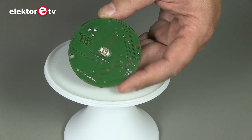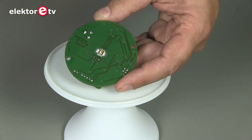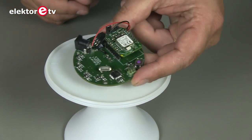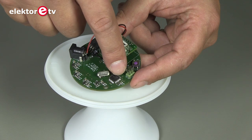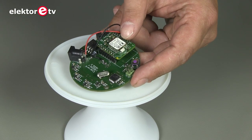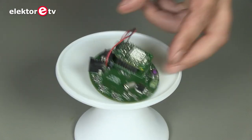The LED is on the backside of the PCB — it is here. All the copper around it is meant for cooling. On the top side we have more copper for cooling as well. The other components include the microcontroller, the Bluetooth module on our breakout board — our BOB, so it's the BL600BOB — and we have the power supply of course on the board.